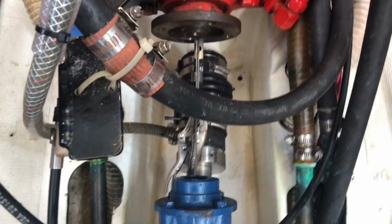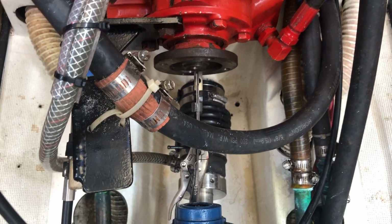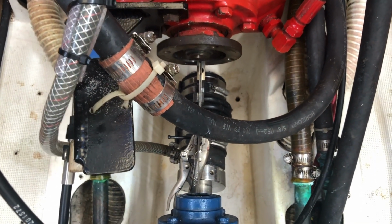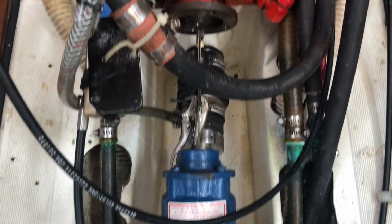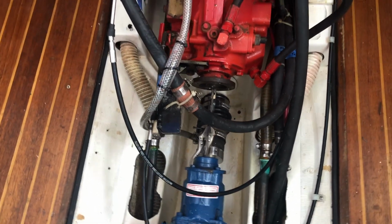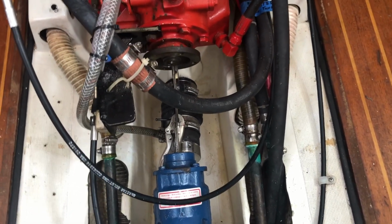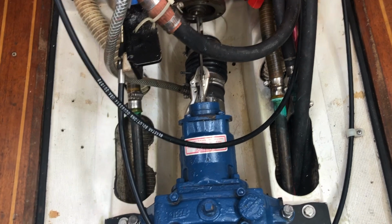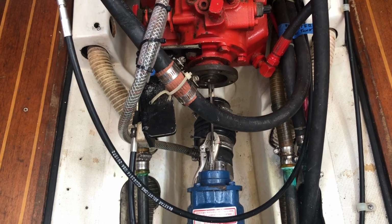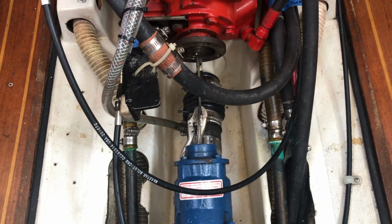We can't really do the kind of alignment with the feeler gauge that I did with the propeller shaft because obviously I don't have mating couplers. And even when the shaft for the V-drive is in place, that shaft includes a universal joint, which makes getting an absolutely precise alignment impossible. However, it's very close, and the Walter Machine Company instructions for aligning the system indicate that with that universal joint in the transmission, there is a tolerance of about 3 degrees.